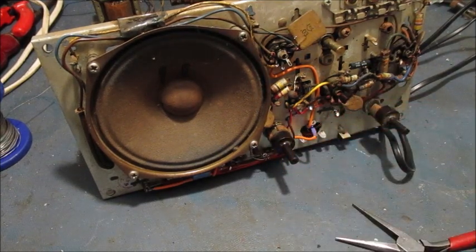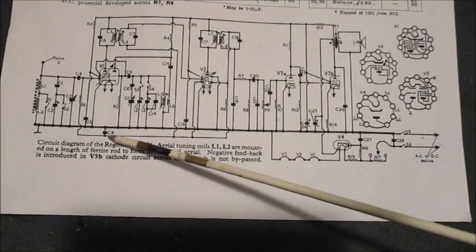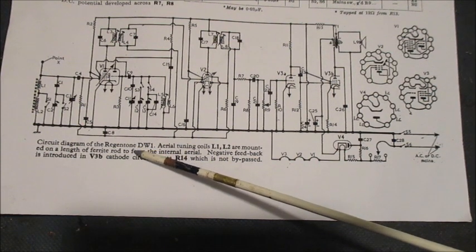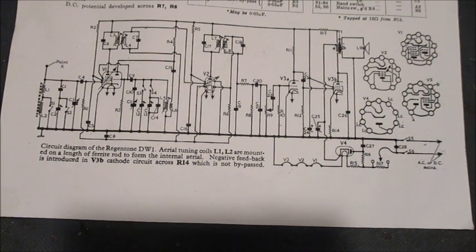Yes, not bad at all. Vast improvement. Why did I single out C8, 47 nanofarad AGC decoupling capacitor, with the sole purpose of replacing it with a new unused capacitor? Yes, I know the original one fitted at the factory was one manufactured by Hunt's, but that wasn't my main reason. Honestly, it wasn't. I think that a wee bit of theoretical background will hopefully not go amiss here.